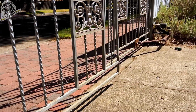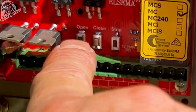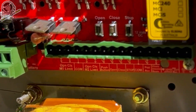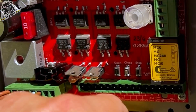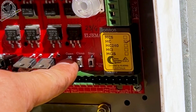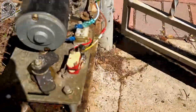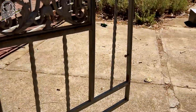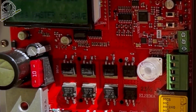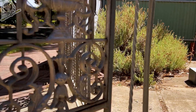Is the gate open halfway? Absolutely not, so press no. Press open or close to set the motor halfway. Down here we've got open, close, and stop buttons. We'll press the open button and see what happens. If you press open and the gate closes, don't worry — just use the close button to open them; you can flip that around later. We'll press open because I think it's set correctly. The gates are opening, so we're going to set them approximately halfway. You can tell which limit switch is going to be the open one if you've set that correctly. That's about halfway — press the master button to set motor to halfway open. That one's opening as well, so we'll set that one about halfway.